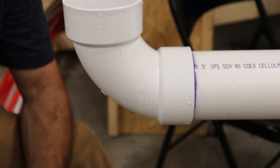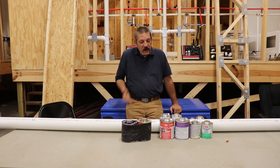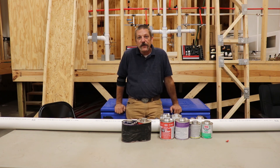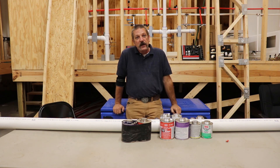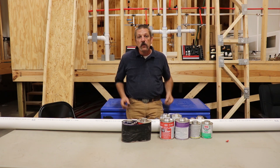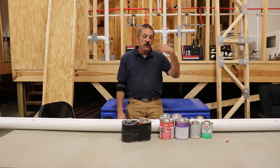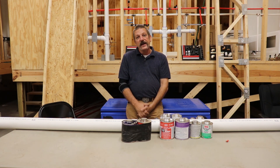That's my little video on your different types of glue and how to use your glue and primer. I'm really glad that fitting jumped off like that, because that's something that happens in the field. You push those things on, you've got to hold it there for a couple seconds — 10, 20 seconds — or it's going to back off like that on you. I mean, I've had some literally push you off the ladder, they were pushing on you so hard because of that chemical reaction. But that's what you want. If it's not pushing back against you like that, it's not hot enough — you let your primer dry, or your glue's old. Glue can get old. Thanks a lot, guys.